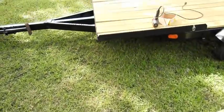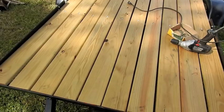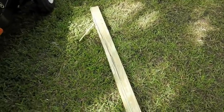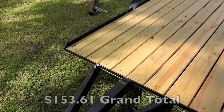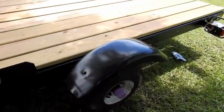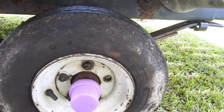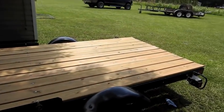On the trailer project, I just picked up a 2x4. It's been a week or two and the boards are starting to go wild, especially this one. I'm going to sandwich it down just like we did on the back — that holds the boards in place and keeps them from rattling. This board was 70% off, a dollar and some change because it had some damage — I don't care, it's going underneath the deck. The front is all buttoned down. I've now got the trailer wiring finished — had to put a ground wire on and put a hook on the safety chain. I just repacked the bearings, and this dust cap I trimmed a little and it fits pretty good now. I'm going up to the weigh station right now — you have to have the weight before they'll give you a tag.